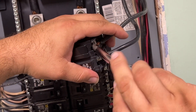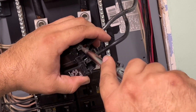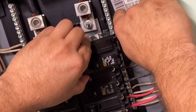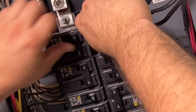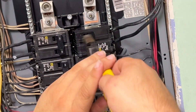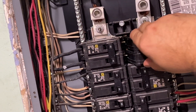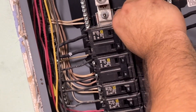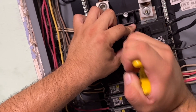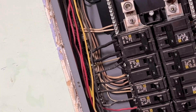Make sure you get it tight enough because you don't want it coming out. Do the same thing with the other side. The tough part is going to be getting it back into place because they don't go in easy, to tell you the truth. You can see how thick those wires are — you want to make sure you get them in there really good and that they're not loose. You've got to slip that breaker in and push it onto those contacts, which is not easy. He had to use his wrench to pop it on there. He had to bang it a little bit, but finally it went into place.